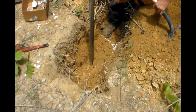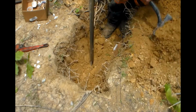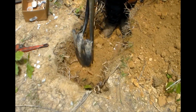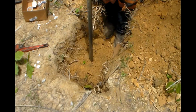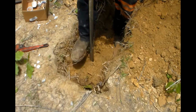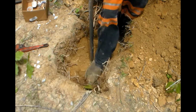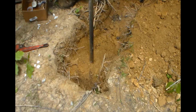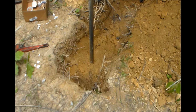And you'll notice I don't put a whole lot of dirt, just about 4 or 5 inches, because when we pour our footers and some other concrete work, I'm going to have some concrete put around it. If you don't stabilize the yard hydrant pretty good, they are easy to bump or move. Someone can hit them and it'll move enough to mess your water line up underground.